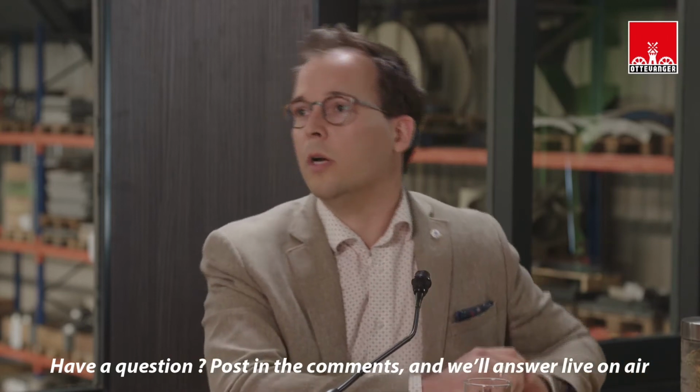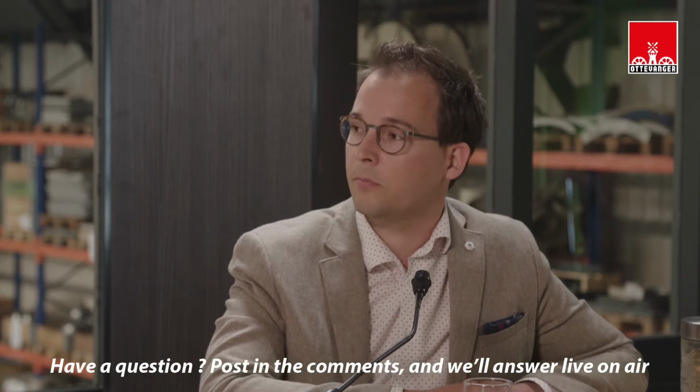What is the smallest particle size that can be detected? I think Wouter already answered that. On the one hand, it's related to your pixel size, which is 18 micron in this case. And on the other hand, it's also related to the texture of your feed component. In case we're having an extremely homogeneous product, like white powdery meal all over, then this is somewhat challenging to measure. But the feed types we saw so far, also including monocomponent components, have a lot of structure in it, a lot of texture variation, which makes it possible to analyze the size variation. Perfect. Next question.